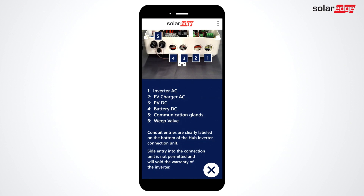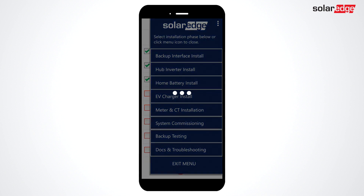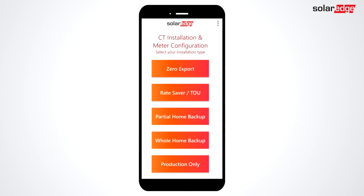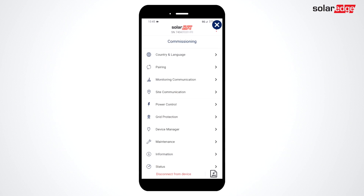One of the more common questions we get is: where do I place CTs, and how do I configure the meter? Meter and CT installation will let you select your site's configuration. Let's select Partial Home Backup. The guide will show us where to install CTs — in this case, on the service entrance conductors with the source arrow pointed towards the grid. And the Configure button at the bottom of the page will show us what settings to use to configure the meter.